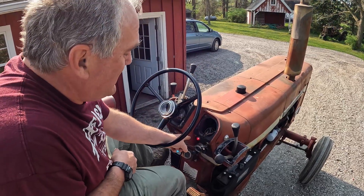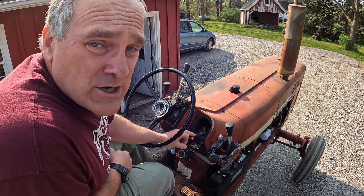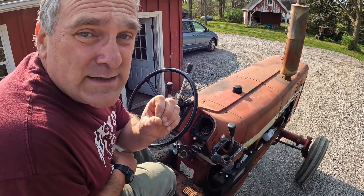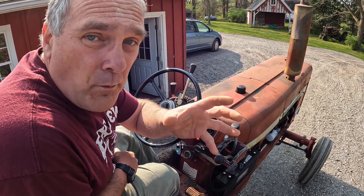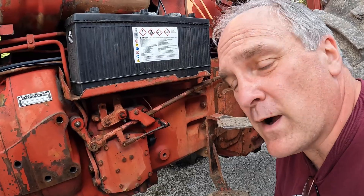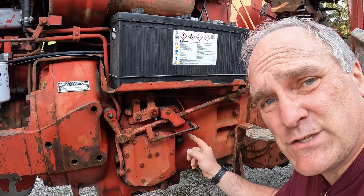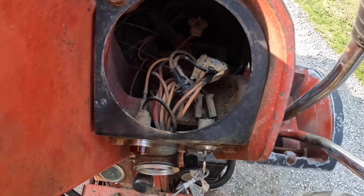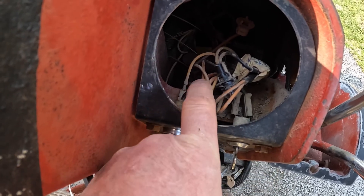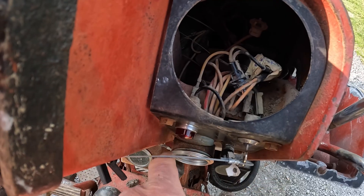Here's the deal with this light — let me start the tractor. The light's on when the clutch is in, and it goes out when I push the clutch out. That light is indicating that the hydraulic system is dumping pressure, because the hydraulic system keeps pressure on the torque amplifier clutch to keep it engaged. When you push the clutch in, you want to dump that pressure so that the gears in the TA and transmission have a little rollback, making it easier to shift without locking up. The light circuit works via a ground switch on the side of the torque amplifier linkage — when the switch closes, it completes the circuit through a hot terminal that's always live when the key is on.